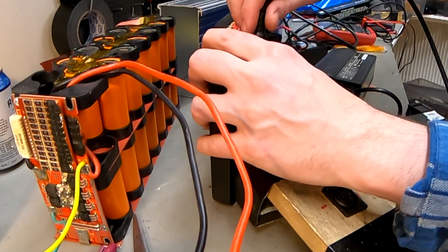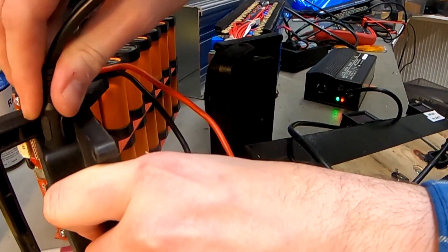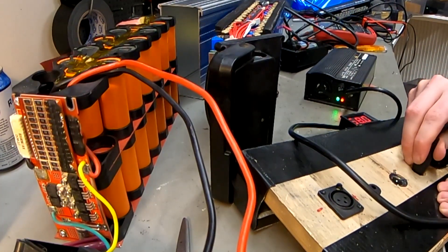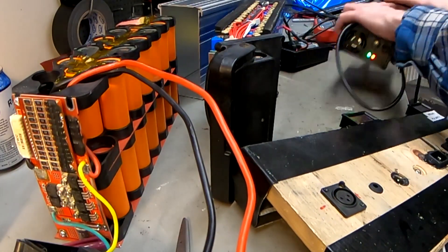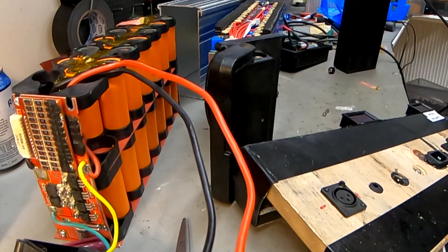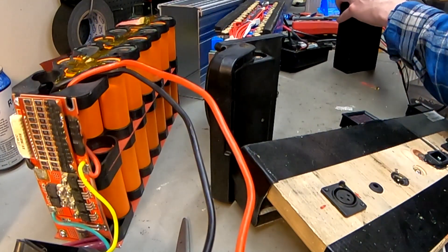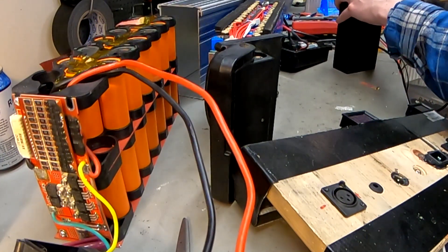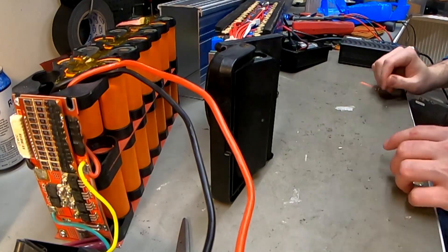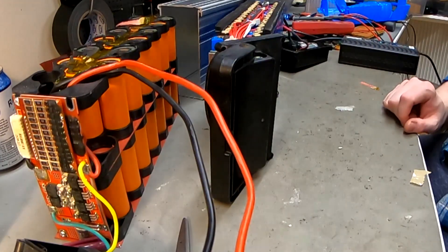That charger charges that battery, but it doesn't charge the other one — and that one should have 58V output. We have one working charger. The fuse is fine. So we have one bad charger and one good charger, and one of the batteries charges with one of the chargers. We will offer him a new charger and a new battery pack — nothing LiFePO4 but with standard lithium. We can build twice the capacity in each battery and avoid all this strangeness.